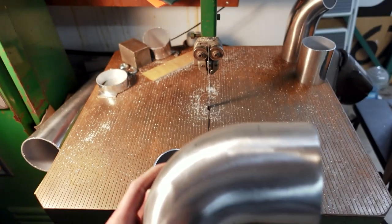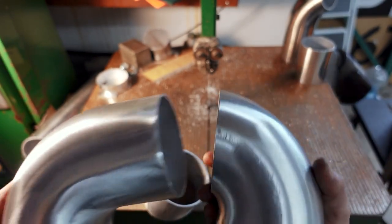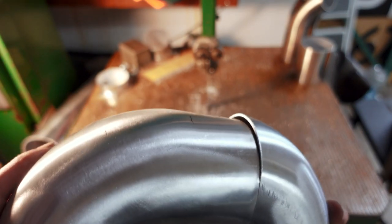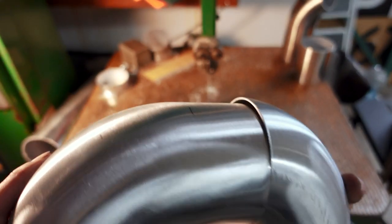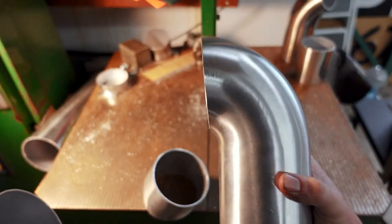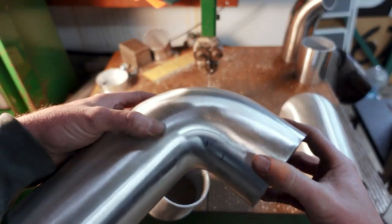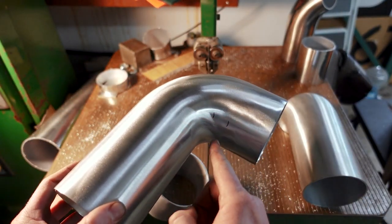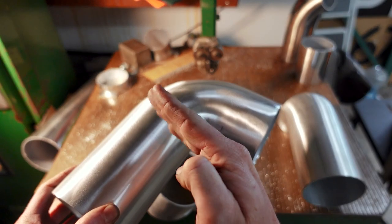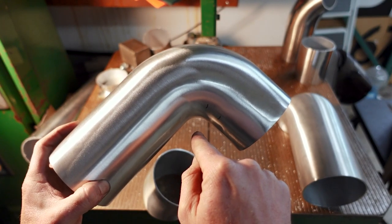The other problem is that it's also now an ovular hole because it's not cut straight. And so if we were to line up the bottoms of these, you'll see that there is a hole at the top, and that's not going to be easy to weld up. So overall, you really want to avoid situations like this, and you want to run your part through the bandsaw correctly, always aiming from the blade to the center point of that bend — the center line of that radius.